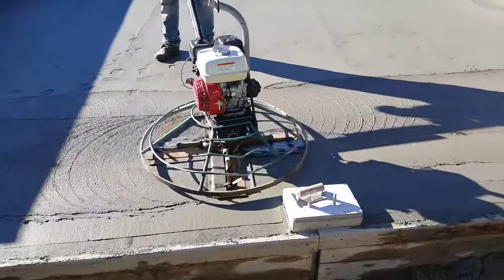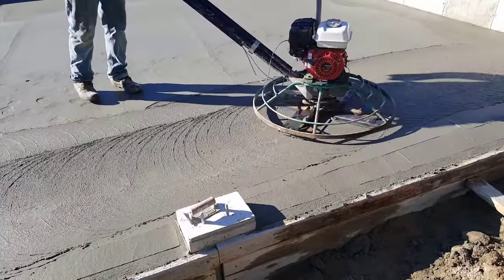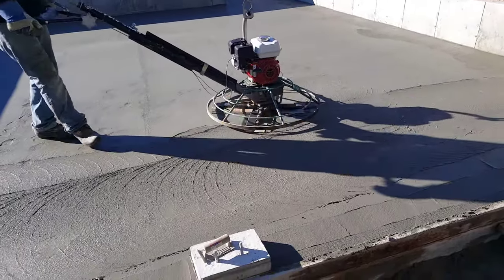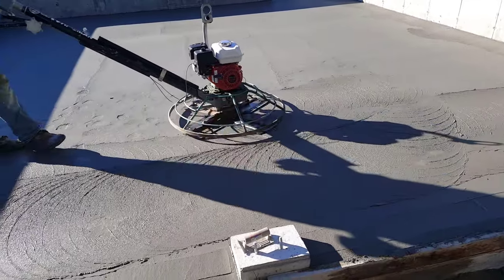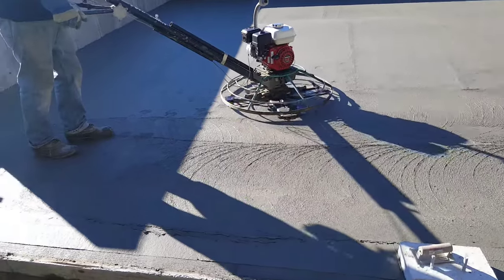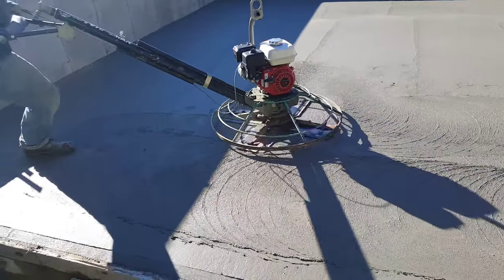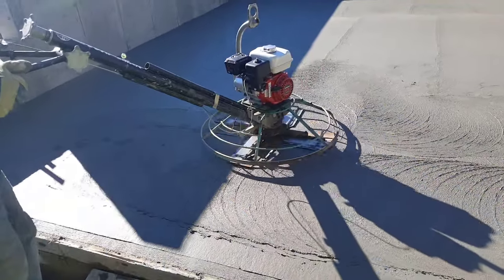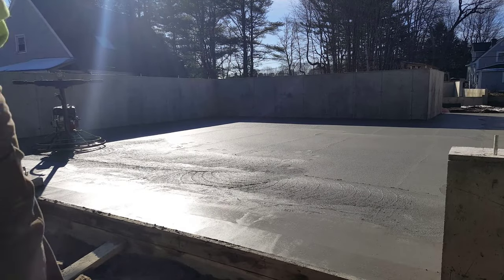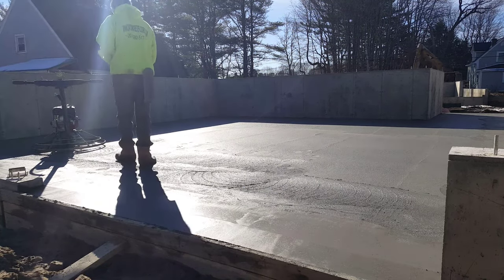So what you've got to do is basically just stop and wait a little bit longer. Otherwise you're going to create some problems in the concrete - you're going to create some humps and dips and things that are just a little more difficult to get out as the concrete hardens up. But as you could see when we first started, it kind of felt like it was ready. Sometimes you just don't know - you just got to get on it and try it. But if you do get on it and it ends up being soft like this, you just stop.